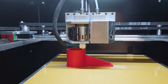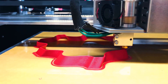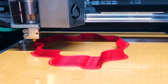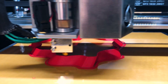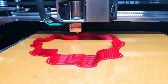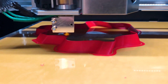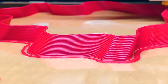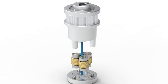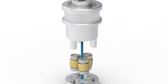The three rollers are positioned at 120-degree intervals around the filament. They're tilted to a fixed angle and rotate on their own axis as the whole carrier also rotates. You might wonder how, with so much spinning going on, the filament doesn't just twist and curl up. There's a very small part inside the extruder which prevents this rotation, positioned as close to the teeth as possible so that the area of slight twisting is as close to the point of force application as possible.